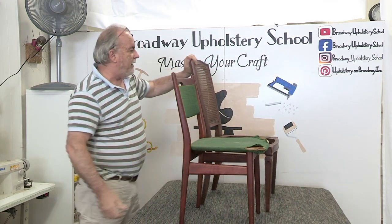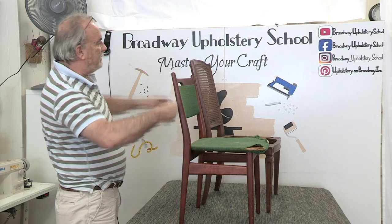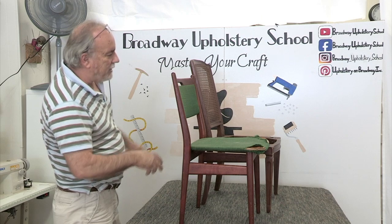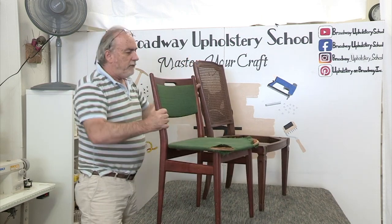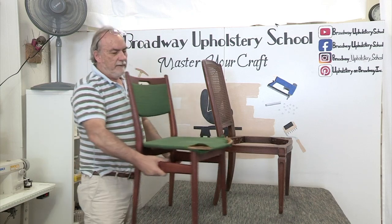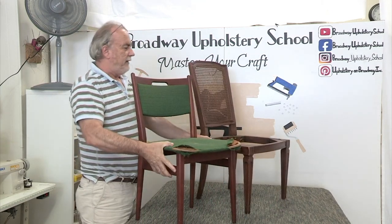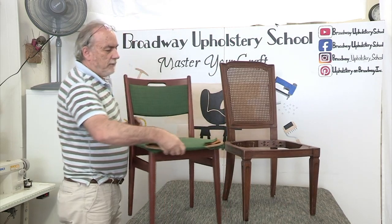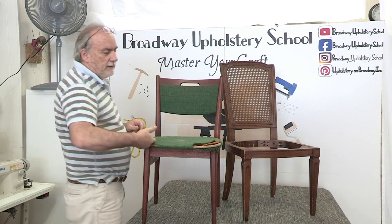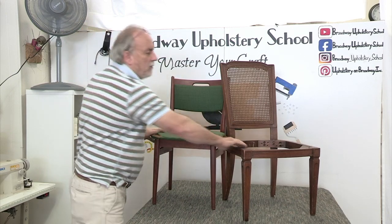One thing that all fine furniture has in common is this 12-degree slope slant on the back on the seats, okay? Now on dining room chairs, usually if you notice, I'm going to turn this around, this is flat. This looks flat from this direction, but it really isn't. It has a saddle seat. So one of the major differences between the design as far as comfort goes is that this is saddled, this isn't. I just want to explain a little bit more about what's going on with this chair.